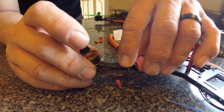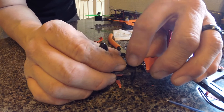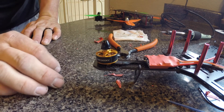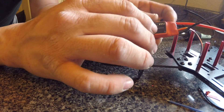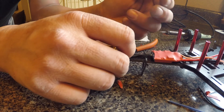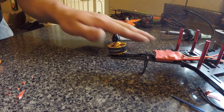Once you're done and you mount it, you're going to have a little bit of play but not so much that you can't twist the motor slightly and make a smooth pass. I could have taken a little bit more to make it straighter but you never know, so it's up to you. I'm obviously going to use 3M double-sided tape along with a zip tie around them just to keep vibration away from the electronics. I would just zip tie it solid normally, but I'm trying to avoid any problems with vibration.